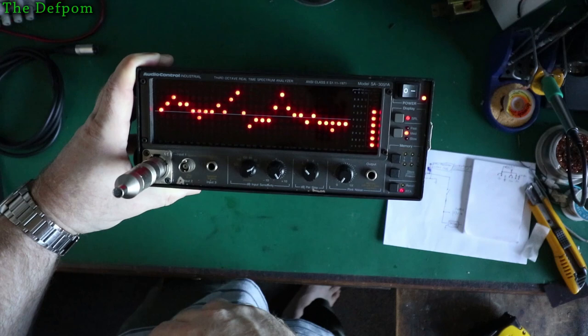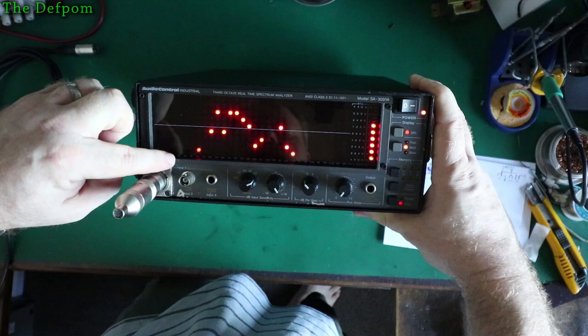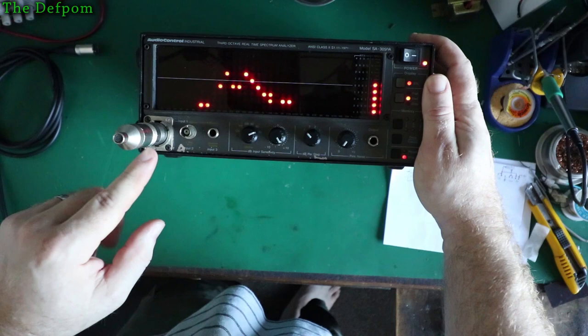So the microphone had problems with picking up mains hum, 50 hertz hum in my case, 50 hertz in my country, which is right here, the big spike down there. That's not showing this one. I thought I'd saved it. I pulled the microphone apart and I put a new wire on the actual insert, so it's unplugged. That's not showing what I mean.